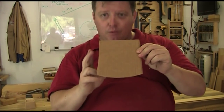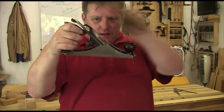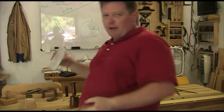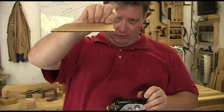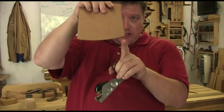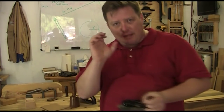This works especially well with a low angle plane. A bevel-up plane like a block plane — your standard plane has a 45 degree bed, but your low angle planes have beds set at around 12 degrees, which is extremely low. So look at that curve at that lower radius — it starts out steep and comes down. If you can make an even narrower curve on your blade, it becomes almost minuscule when laid in the plane. And having that minuscule curve actually eliminates a lot of your problems.